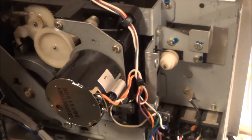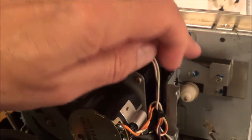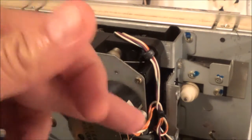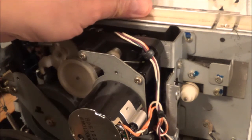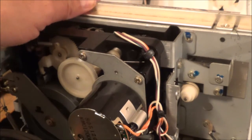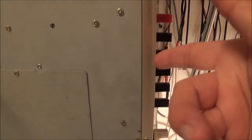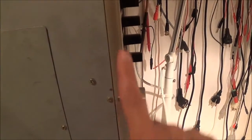I need to get to the counter belt, and I also noticed the eject mechanism isn't working. To get this mechanism off, I'm going to remove some screws — there's one there and one there. In almost all cases there are screws on the bottom too, so I'll flip the unit over. I may have to take off the faceplate and pull the buttons, but that shouldn't take very long. Looking at the bottom, it looks like two screws here and two on the top for the mechanism. To take the plate off: three here and three on the bottom, with two on the other side.